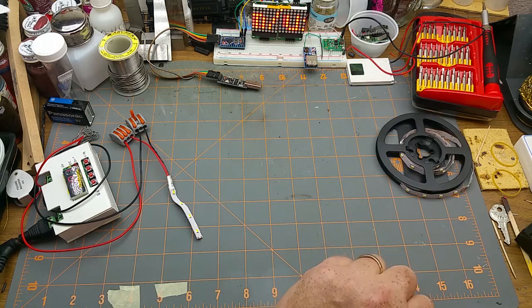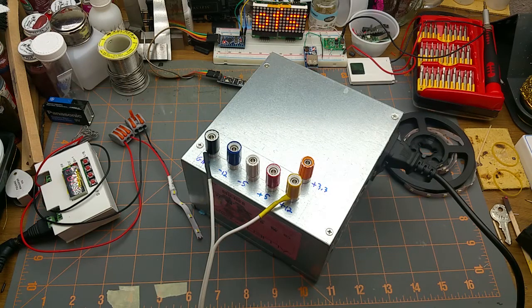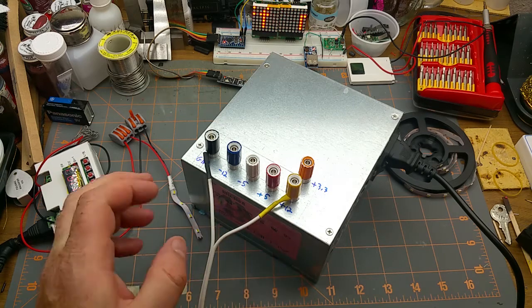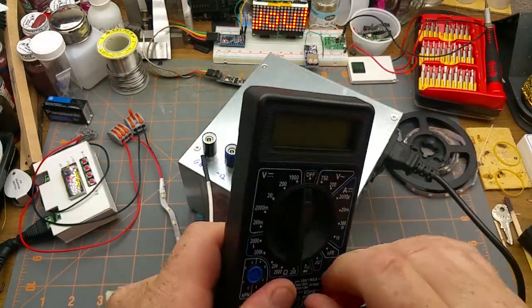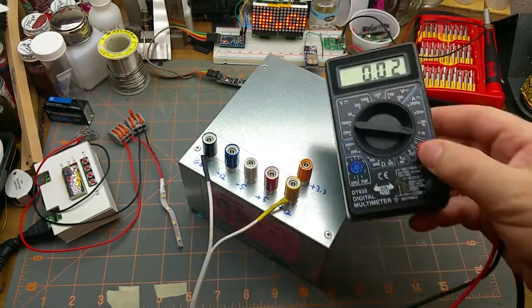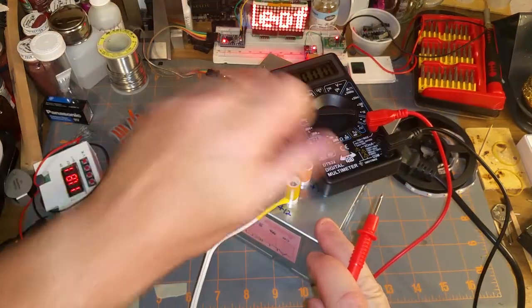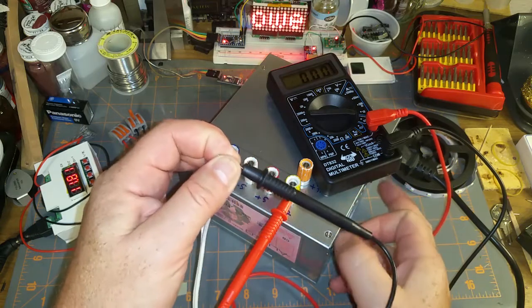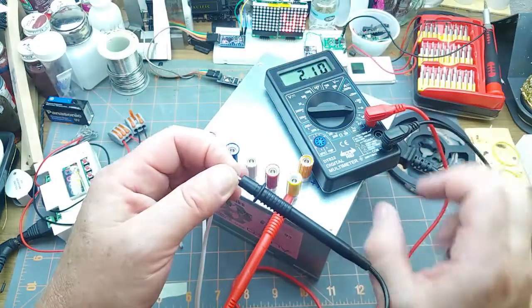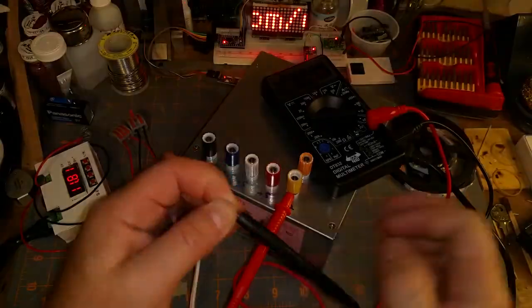That's one thing I wanted to learn. Right now I'm powering it off my old computer power supply turned into a bench power supply, which has gobs of power, but I wanted to see how much current this whole pile is drawing at its voltage. I'll connect the ammeter in series — since it's low voltage I'm not too scared to do this. The whole thing is drawing about 2.2 amps.